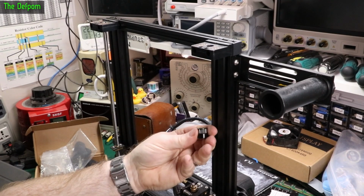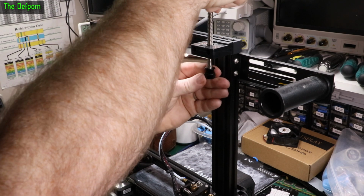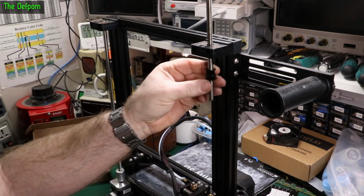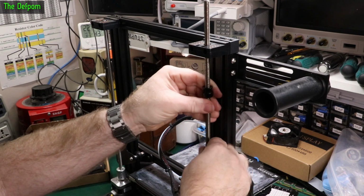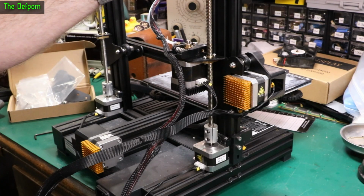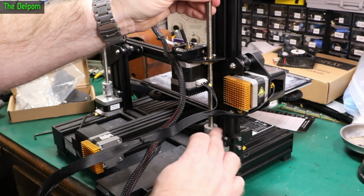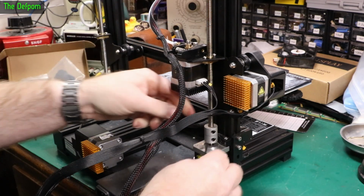So now I'm going to put the pulleys on. I'll do this side first. It's already apart. I'm going to slide that through. That should just basically slide in. Now I'm going to wind this through this brass footing at the bottom there. Wind it right down. That should go straight into the motor. Okay, so we've got one pulley on here. That's now tied into the stepper. I can now tighten this one up. It's definitely right down, so we'll tighten this one up.